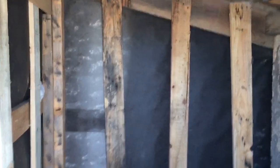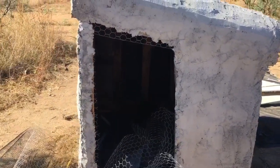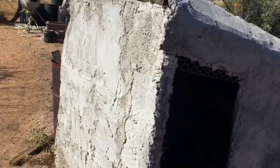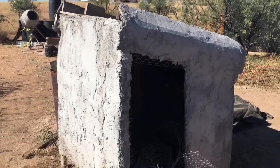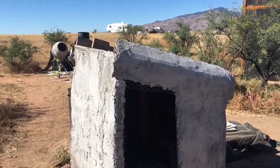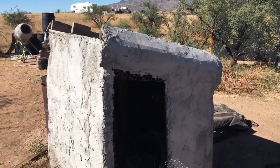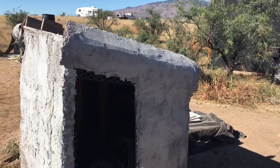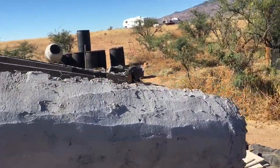Taking it a bit out of context, the point was that you can stucco over gaps like this, and I did not know that. So I decided to do a little experiment — everything's an experiment out here. I just put together this basic frame underneath, and that's all that's under this stucco. Once stucco dries it's pretty hard since it's mostly cement and sand, and there's minimal cracking — only where I tried to move the thing after applying it, like a moron.